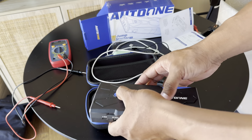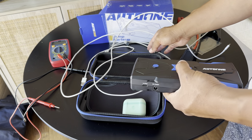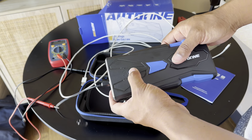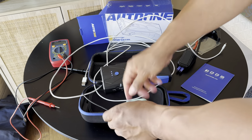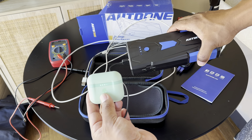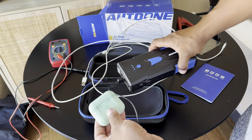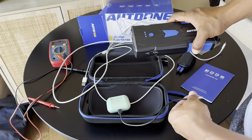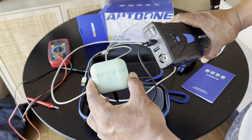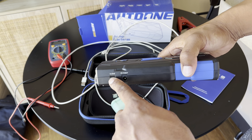Anyway, you have your USB-C port and a DC plug. Looking at the USB outputs — one puts out 5V/2.1A and the other is a quick charger, so that puts out a little bit more voltage. So this one is your standard 2.1A and this one is a 3.0 quick charger with a bit more juice if you want to charge something faster like your phone.